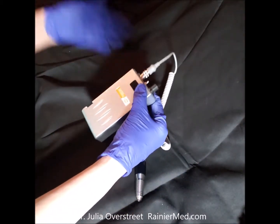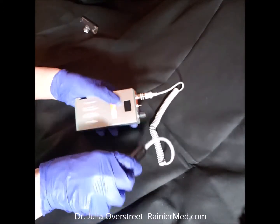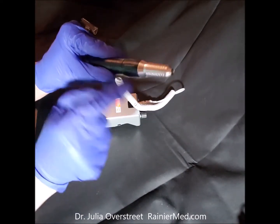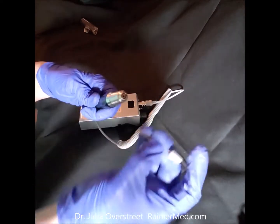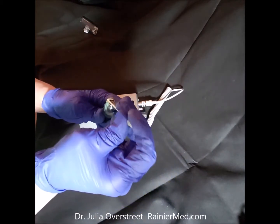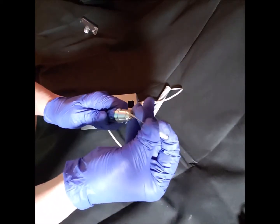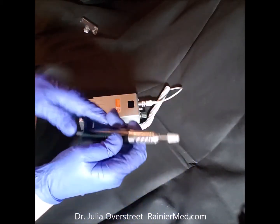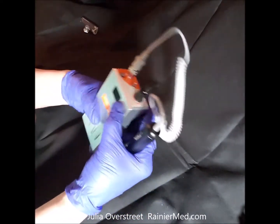That comes in the box — it's part of your package. The handpiece is very well balanced and constructed. This center section here is what you will turn in order to take burrs in and out. That's the only part of the handpiece that you will twist. I couldn't get it in there — it means I just need to twist it the other direction. Push it in all the way and then turn it until it clicks again, and now your burrs are very nicely contained in there.